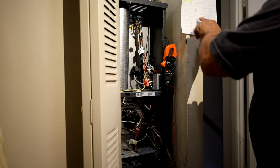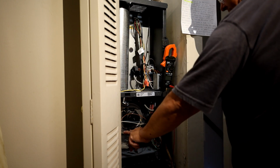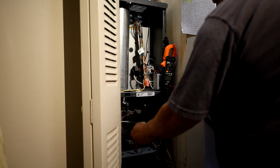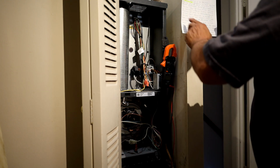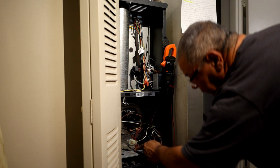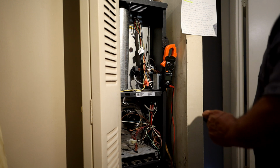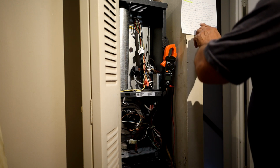If the igniter glows, which is down here on the gas tray right here, mine is over here in the front. If it glows and the gas tray doesn't light up, you can change the igniter, or you gotta check your gas valve, make sure the switch is not off. On new installations, if they do it in the summertime, they will forget to put that switch on. Gotta check that, alright? Check all limit switches. There's little switches down here. They got a little button. 2 of them there. And you just push them in, like on a hot water tank. I'm going to put a link for that in the description below also. Okay?